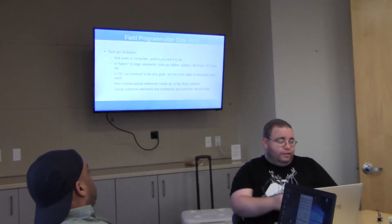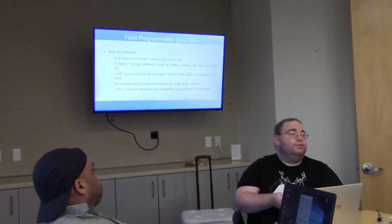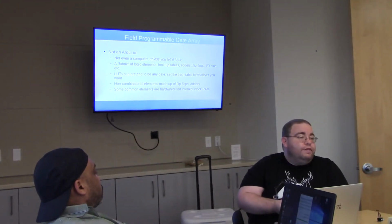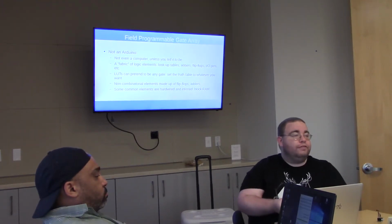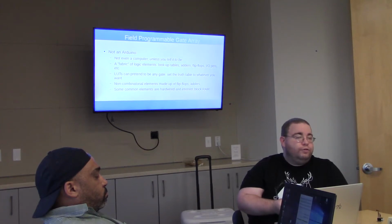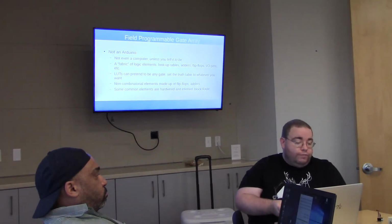Like most of my talks, I'm going to begin with: an FPGA is not an Arduino. Most of us are familiar with the Arduino microcontroller mindset, where you're setting pins and reading data from pins, and it's a computer that runs a C-like program that's dealing with data on pins. An FPGA is not that at all. It's not even a computer, really.